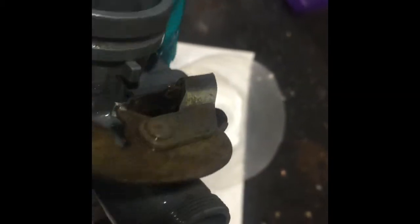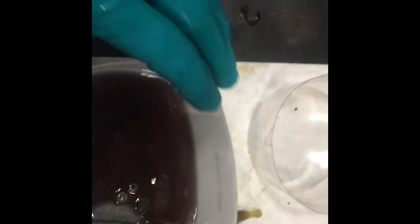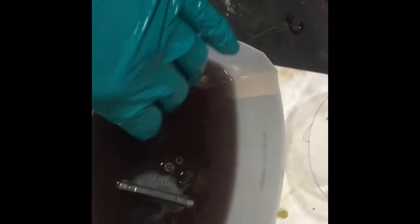Anyway, it's looking really clean now — see how shiny the brass parts are getting? It doesn't look like it's taking the corrosion or the plating — like the CAD plating — off the steel parts either. So it looks like it works pretty good. I'm gonna post a video of what it looked like when I first put it into the Super Clean and water solution; it kind of started reacting and you could tell it was cleaning really well.